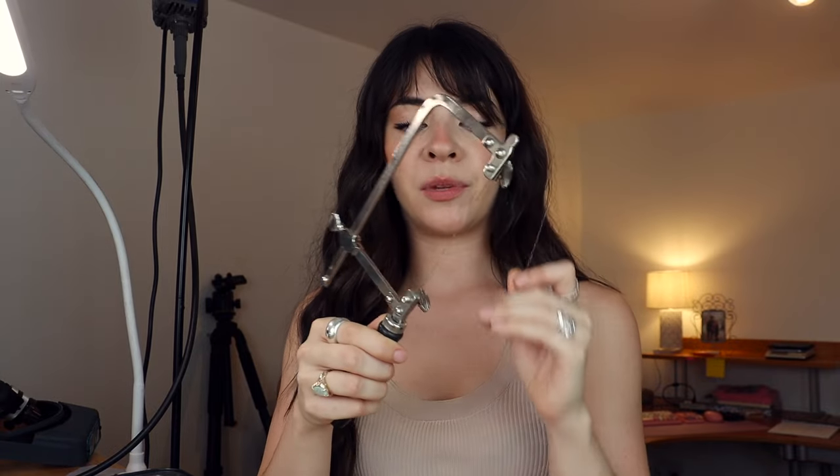Then to cut the actual tube itself, you're gonna need different blades for your jeweler's saw. You can use the blade that you already use for metal, but when you're carving through huge chunks of wax, you're gonna want the spiral blade. It has big serrated edges and it's in the shape of a spiral so it can cut through all the wax. If I used my metal one that I use for sheet or my ring bands, it would take forever to cut through it.